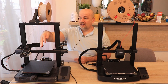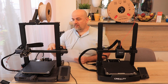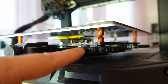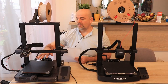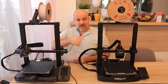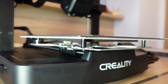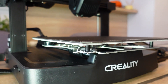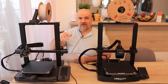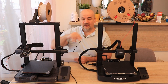For manual leveling, on the S1 we first have to do manual leveling by adjusting the knobs to make the surface parallel with the nozzle's movement plane, and only then do the auto leveling. On the V3, the bed position is fixed so it has only auto leveling done completely automatically. Any inaccuracy from a perfectly leveled surface will be compensated during printing along the Z axis.